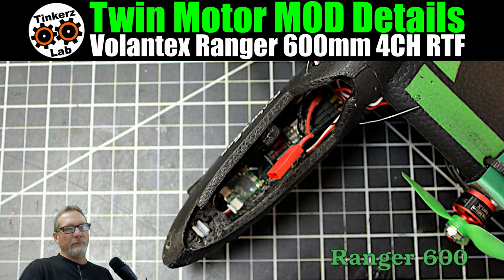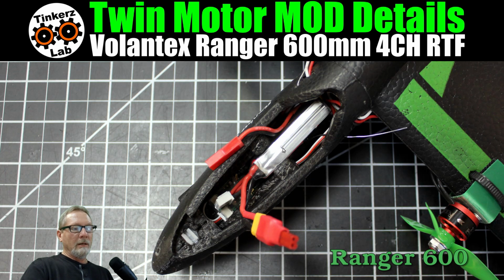and then I just punched a couple of holes over here to bring the antennas up where they were away from the battery and the electronics, and also out of reach of the props. And that worked out really well. And then my battery sits right on top, mounted in there vertically.